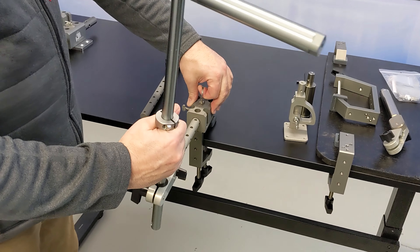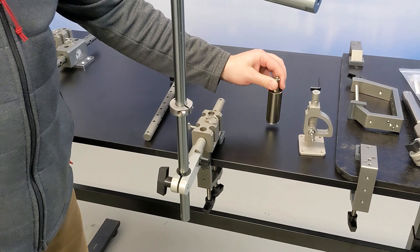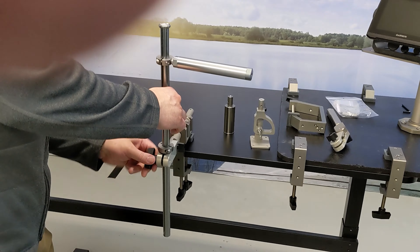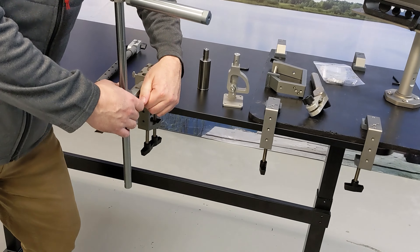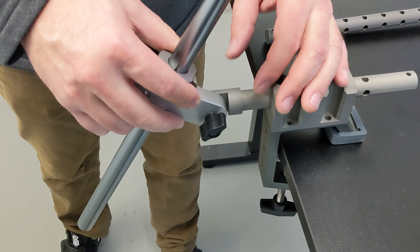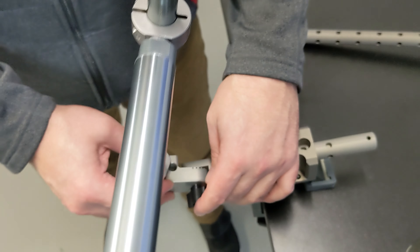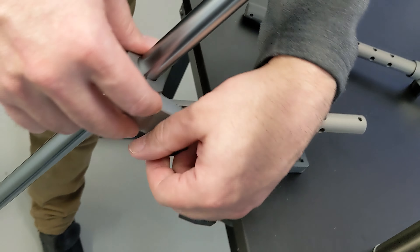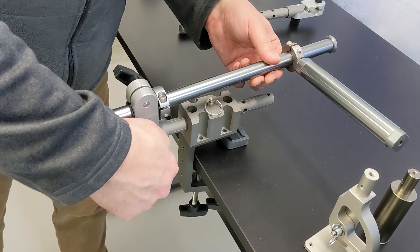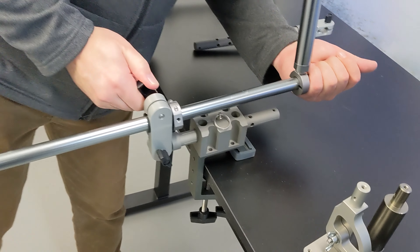Going back to this unit — we'll pop the beam in and pull the pin. There will be a linchpin included as a safety mechanism so you don't accidentally pull something out and drop it in the water. We'll pop it down and I'll show you the tilt adjustability. It's made on a sprocket-type pattern — you can see the teeth here — so you can adjust at various angles and lock it in. You can not only rotate but also tilt the whole thing up out of the water.